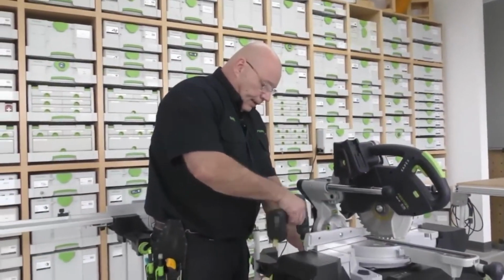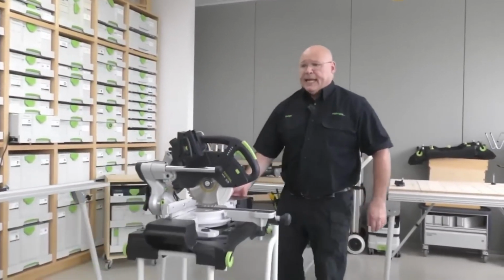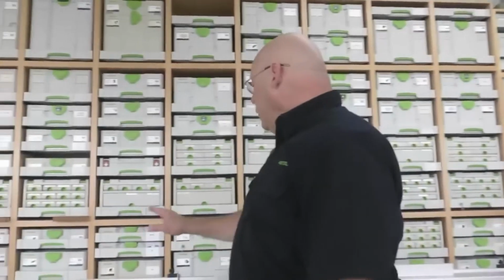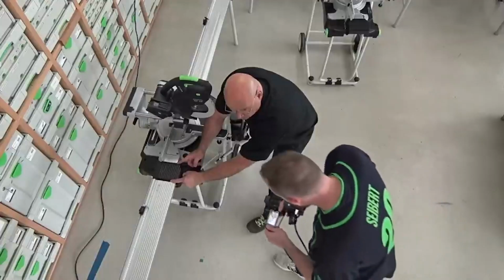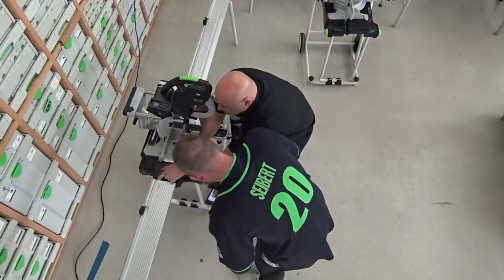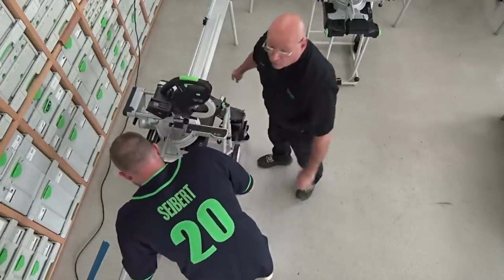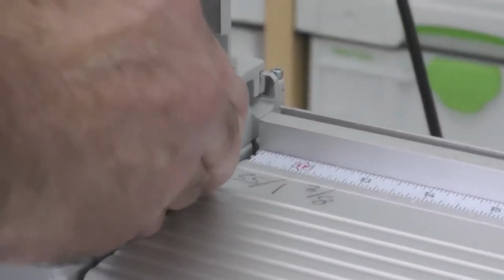The reason I want to show you this is that the big difference is the extensions. If you have extensions for a KS120 and you want to use them on the KSC60, you may. But your scale will not line up because you have this little extra piece here. Follow me? This little extra piece is kind of cool. It's roughly 115 millimeters. So that scale is off if I put these on the KS120. Because on the KS120, it mics right up. This is a little larger, but this mics right up to it. See that? Both of them have V-grooves. This one's plastic.